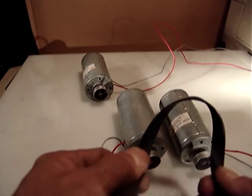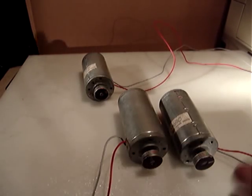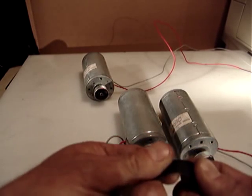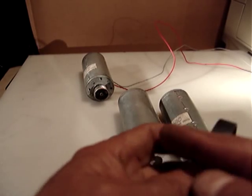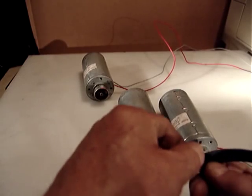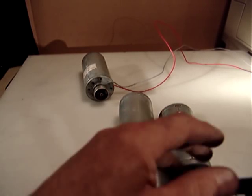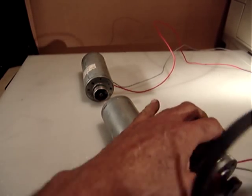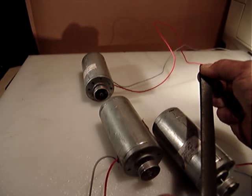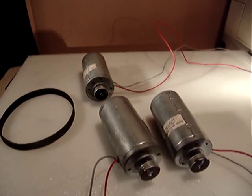I found this belt. You have one, two, and three pulleys — you'll need one for the other part of your machine, whatever application you have. This belt has two different shapes: one is kind of linear and this one is different, wider. I notice this one could fit into the grooves of the pulleys, but this one is larger. If you carefully cut it in half — the way I'd do it is hold it tight and straight and cut with a very sharp cutter.